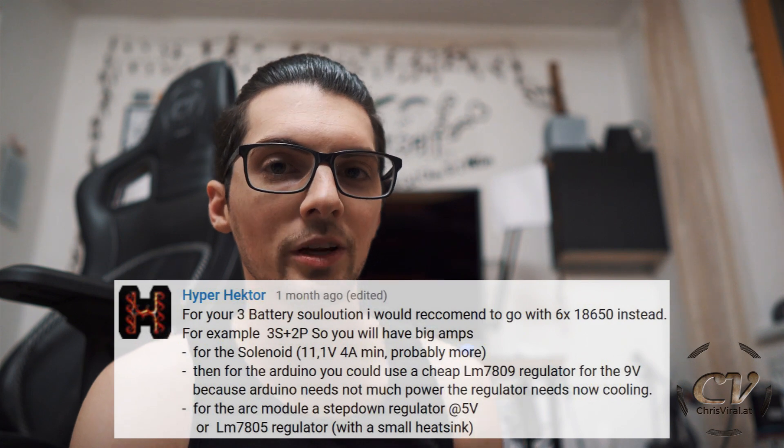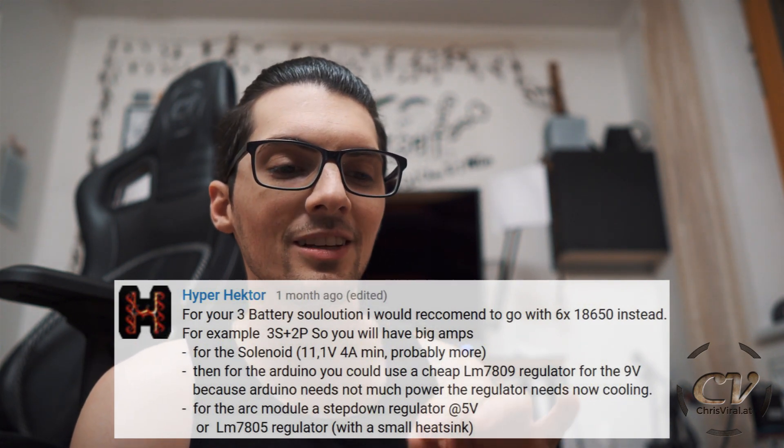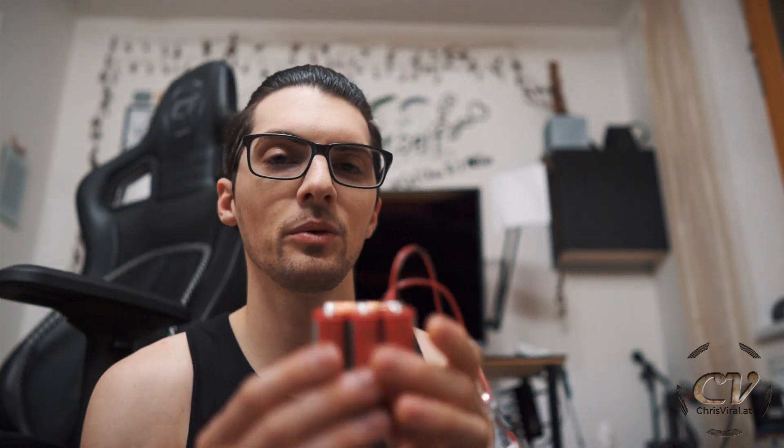I had this comment for a long while — this was basically bound to happen. Also this comment from Hector — thank you so much, as always. I already purchased all these LM78 modules; the last two digits are for the voltage, that's what I've learned. I think I bought five 5-volt, four 6-volt, five 9-volt, and five 12-volt modules. The reason for all of that is mostly the flame fist — all flamethrower build progress is linked here. This thing needs way more power than expected. Hector suggested 3S2P, but I think that's not enough, so I went with 3S3P.